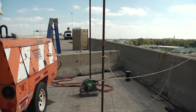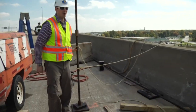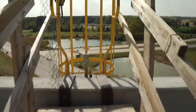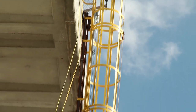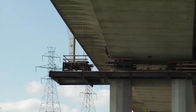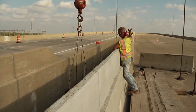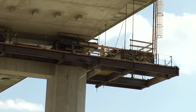On the other side of the bridge deck are the other four post-tensioning rod locations that support the work platforms from below. To get access to the work platforms, the contractor devised a scheme where we go up over the barrier, use our lanyard, tie off onto the ladder cage, and crawl down onto the work platform. The platforms are fitted with two exterior smaller platforms on Hillman rollers that can roll back and forth, which the contractor uses to lower heavy equipment onto the platforms, slide them into place, and also to remove existing bearings and insert new ones.